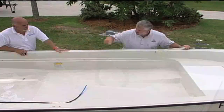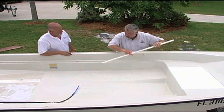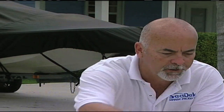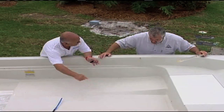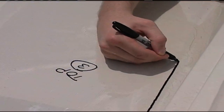I have a relatively flat section of molded-in non-skid, then it goes downhill and we have another flat section in the middle, then uphill to another flat section. How do we address those compound curve radiuses with a template — it's going to be crinkled and wrinkled? Real simple — you just trim it with a razor knife or shears, trim it off the gel coat right at the edge, and tape it down on both the trailing and leading edge sides so you have a nice flat surface. Then with the Sharpie, you literally just trace the outline of your non-skid patterns all the way around.